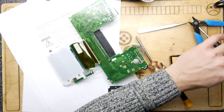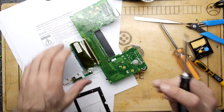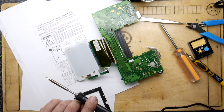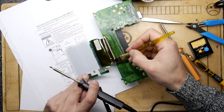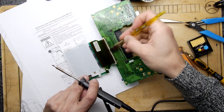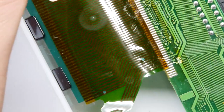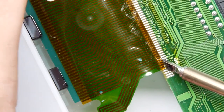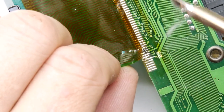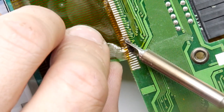I'm not going to peel it off like tape - I'm going to de-solder it. That is hair-raising, to say the least. Let's get some flux on here too. That is a bit dodgy - I would definitely not recommend peeling it off like tape unless you want to lose some of these pads. Admittedly you might not need them in this mod, but if they're there you want to try to keep them.